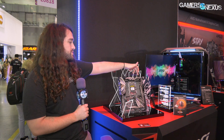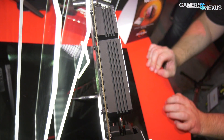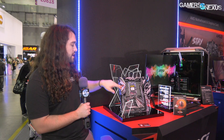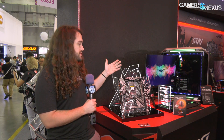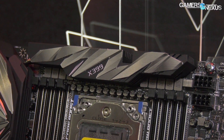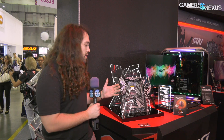For the VRM heatsink, it's got a heat pipe running through it. This whole primary section is the V-Core VRM — 16 power stages with the chokes and inductors on it. The VRM heatsink is not 100% final; there might be some changes before finalization. We're hoping to see some more fins diced through the top — we've provided feedback for that. Because if they're dealing with 250 to 300 watts, every little bit is going to count for V-Core VRM cooling. Beyond that, having a massive VRM does spread the thermal load over a wider surface area, which helps deal with the heat load coming off Threadripper.